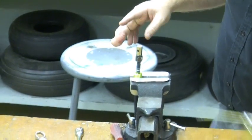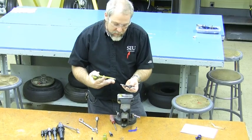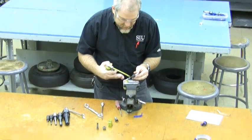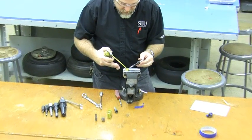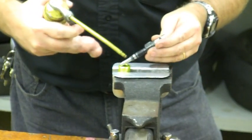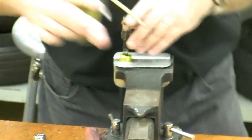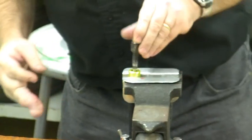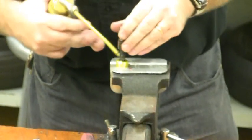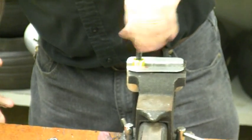There's one more thing we need: lubricant. The best lubricant you can use is whatever fluid is going to be running through your system, so we're going to use system fluid. Lubricate it until you think you've lubricated it enough, and then lubricate it some more — you cannot over-lubricate one of these hoses. We've got a lot of lubricant on there right now, which means I probably want to use a little more. Now we have plenty of lubricant and we are ready to insert it.